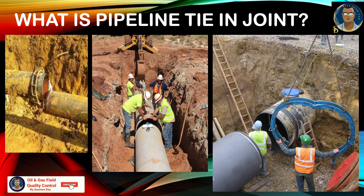It is often the final step in pipeline construction, modification or repair. But I also have a different practical idea — not always is the tie-in the last connection. Tie-in can be tying two spools together; for example, 10 pipes connected on one side and another 10 pipes on the other side, or few kilometers on one side. These are also tie-in joints, and whenever tie-in comes, it brings some difficulties and some restraint, which we will discuss today in detail.